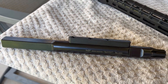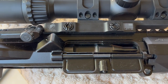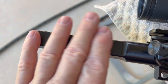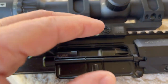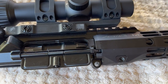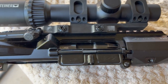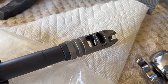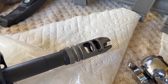The garage is kind of a disaster. That's what it looks like inside. This part here will go in the vice, and this locks the receiver and the barrel together so nothing moves and nothing can hopefully get damaged. So let's go out to the garage. We'll get that thing timed and get that jam nut snugged up, and I'm going to start out at 10 foot-pounds — I may go to 15 but I'm definitely not going above 15 foot-pounds.